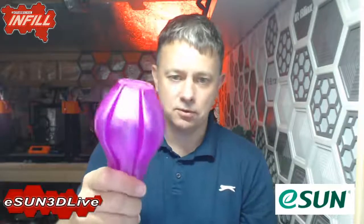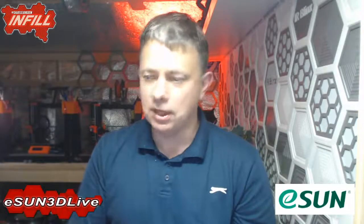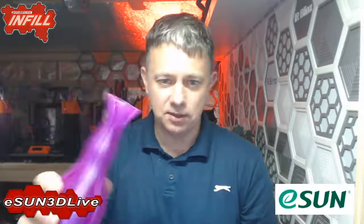But the trick on this is that, let's see if I can get the sound. It's completely squishable, and it just shows the total inverse of that quite stiffness. So when there's no infill in it, that's what you get. And obviously you can play around with that. The number of perimeters and so on will really make a difference to the flexibility of that. That's quite good when you see it wobbling, isn't it?